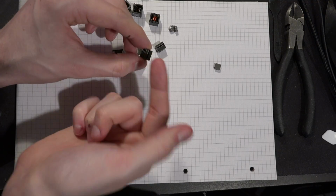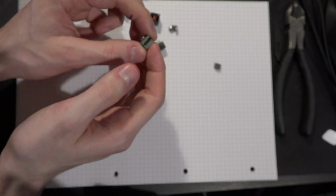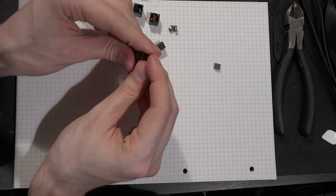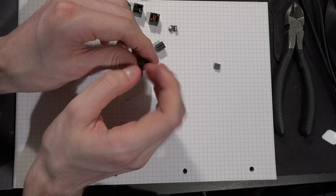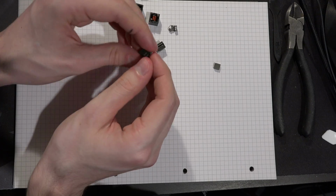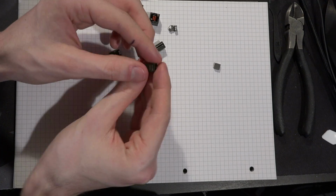Vega uses this style. Vega's coil whine, the reference boards do. The R9 290X, this style of inductor, also has coil whine. Fury Xs sometimes have coil whine, still this same style of inductor. What else? GTX 480s, at least the one I had, coil whined. So you run into a lot of just this construction style is inherently worse for coil whine.